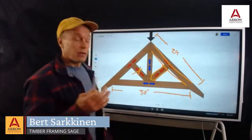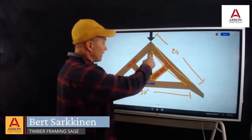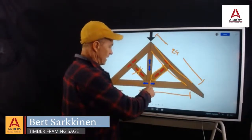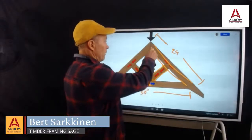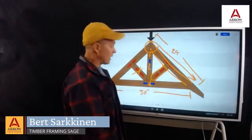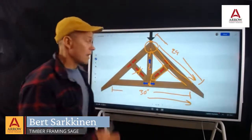And this then compresses and it pulls down. It looks like king posts are holding things up, but really they could be a cable. So we have pressure down, right? And that downward pressure pulls on this. When it pulls on this, we get more force going down to the wall, and in which case gives us more force outward.